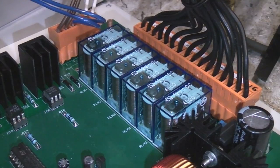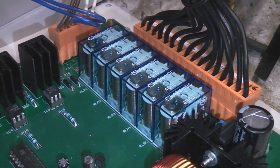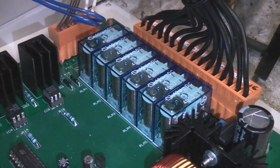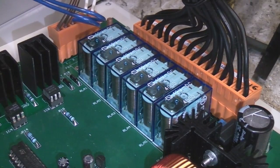voltage. And if I actually just turn this on at a few different voltages, you should be able to see different permutations of relays clicking on. Yeah, I'm gradually increasing the voltage. And see, it's just switching different transformer windings in to best match the voltage that it wants. It's probably a 1:4 ratio on those or something.